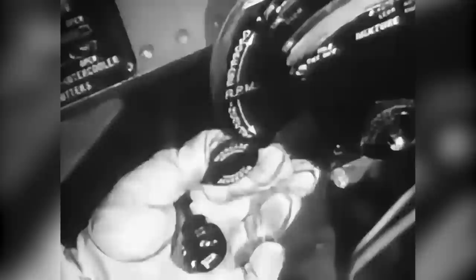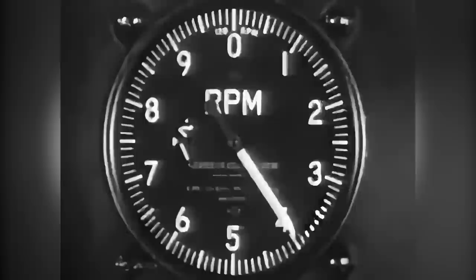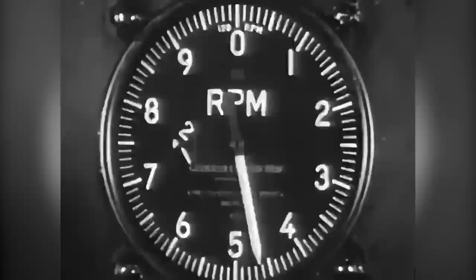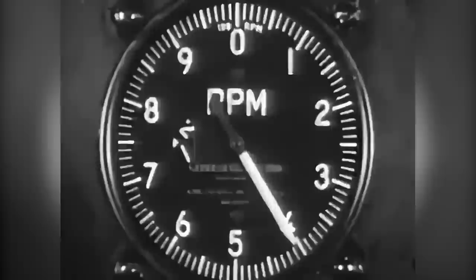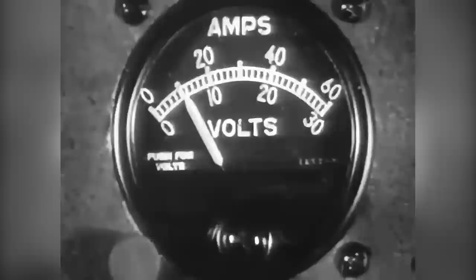For close adjustments, turn the vernier clockwise to decrease RPM and counterclockwise to increase RPM. In order to prevent an accumulation of sludge in the blower clutches and to check on the operation of the auxiliary blower, set the throttle to give an engine speed of 1,400 RPM with prop in full low pitch and mixture control in auto rich. Shift blower control quickly from neutral to low auxiliary stage, and when instruments have stabilized you will notice a slight increase in manifold pressure and engine RPM accompanied by a slight drop in oil pressure. A further shift of the blower control from low to high should be followed by another small increase in manifold pressure and engine RPM, but oil pressure will remain fairly constant. Be sure and return control to neutral in one quick positive move. Finally, check your ammeter to be sure the generator is charging properly, and don't leave the line unless it is.